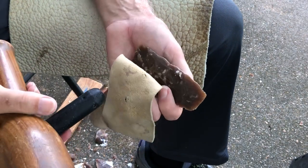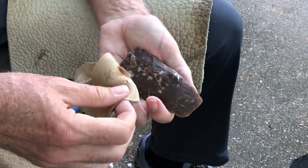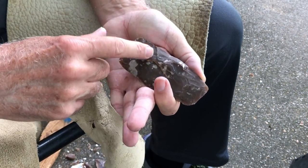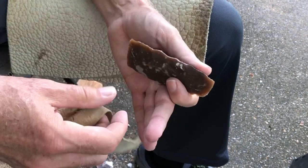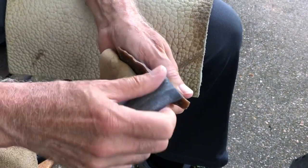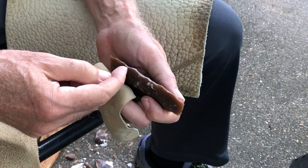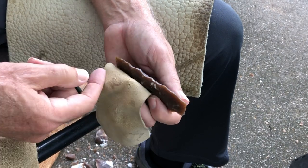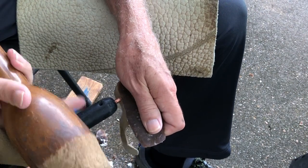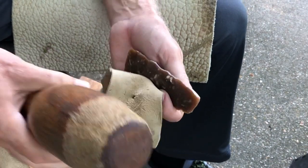I'm leaving this delta here and skipping over where there's no isolation or anything to help me, just to show magic at work. I got that hinge off and I drove that thing over there, and that went over that way, which didn't do any good, except it kind of lowered that a little bit. So now we'll do punch isolation. This is running over that way, which is weird. So I'm gonna put the punch on here and aim back this way, angle that back this way and do a little dink down and just move my ridge over a little bit just to show you that I can do that.